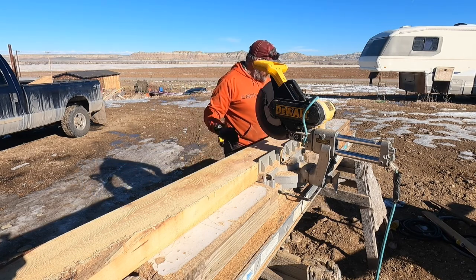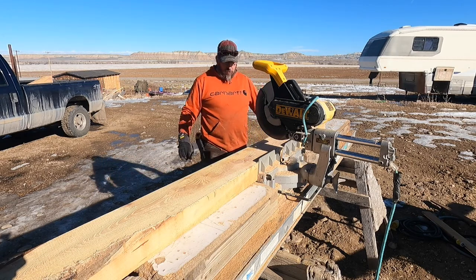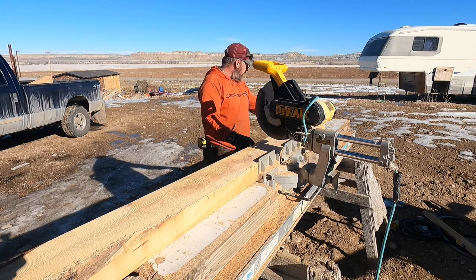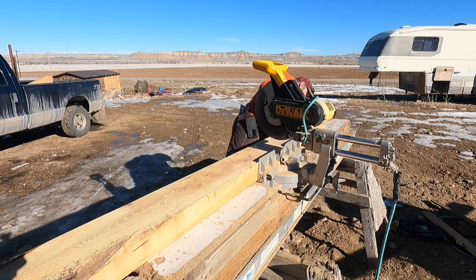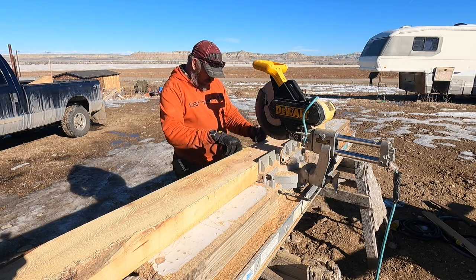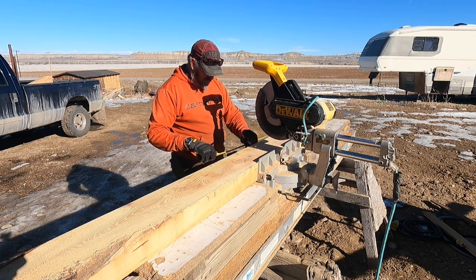We'll start cutting these out. The measurement on the actual rafter from long point to short point, I think, is 44¾. I'm just going to go ahead and use the chop saw. Get cut there, so 44¾, whoops, got inchitis there.